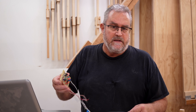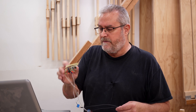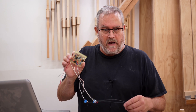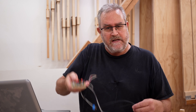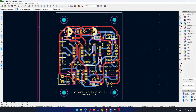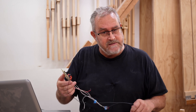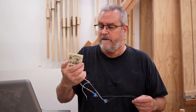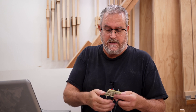The next step — usually the most time-consuming — is to make a board layout that works. This is going to be a double-sided board with traces on the top and bottom, fairly compact because I have 10 of these inside the amplifier. After I have the layout done, I've got two options: send the design off to a board house to have the boards professionally made, or make my own board like I did here and test it out to be absolutely certain it works.